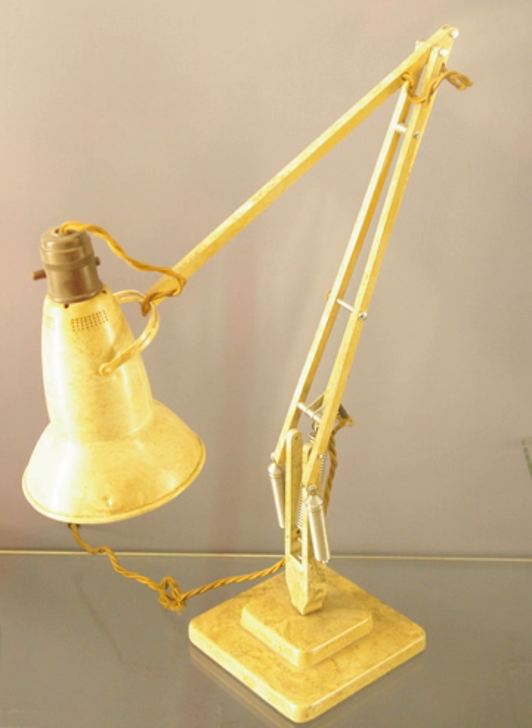There are different methods to balance the lamp cap of a balanced arm lamp. Some lamps have two coil springs working in parallel on both sides of the pivoting arm. A set of springs functions in the same way as a single spring. Others are balanced with counterweights, a method frequently used in drawing boards. Friction between parts of the lamp arm can also be used to maintain balance. There are also mechanical solutions including coupling, hydraulics and pneumatic arms.